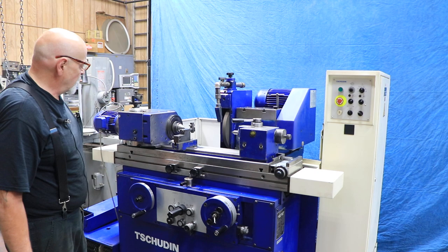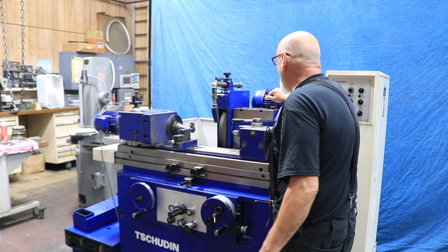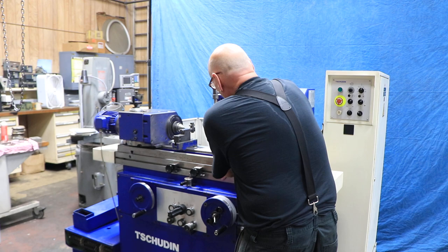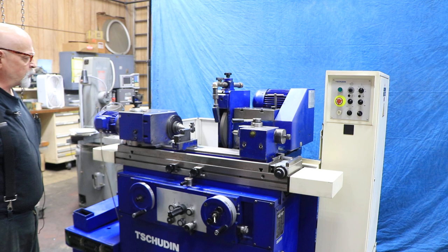The second position will bring the wheel slide forward. This wheel slide has a little T-handle wrench back here and I can move this wheel slide relatively easily in and out because we cleaned everything up. So you can make a coarse adjustment. You can even buy an accessory that gives you a little handle there, but this doesn't have that — it's very convenient, you can move that back and forth.